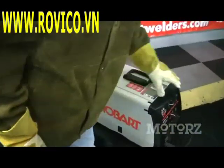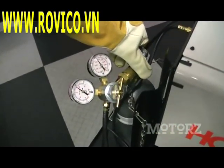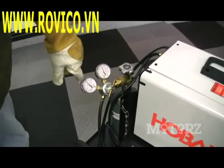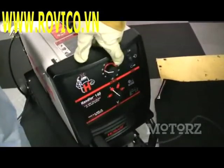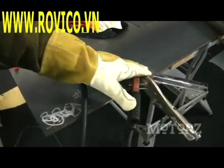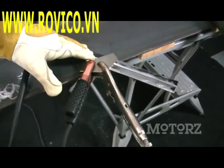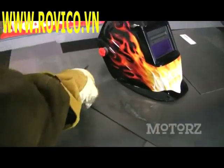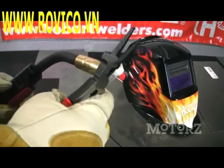Alright Chris, let me show you. We'll turn our welder on, then open up the gas cylinder — you only need about a quarter turn on this. We're going to adjust our regulator to get a gas flow of about 20 to 30 on the regulator; you'll see this needle will go down when we actually start welding. We're starting with some eighth-inch thick mild steel, so we've got our wire feed set to 30 and we're starting with a voltage of 2. We've already got our pieces cleaned up and prepared — it's very important when doing any MIG welding that you remove any rust, grease, or contaminants from your steel, so we've already sanded these down with our angle grinder. We've got a good solid clamp and our ground is attached. Finally, we want to prepare our gun — you don't want too much wire sticking out when you begin; about three-eighths to a quarter inch is plenty, so trim off any excess wire before getting started.